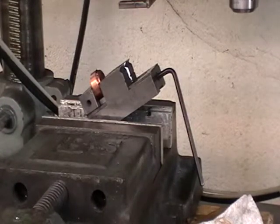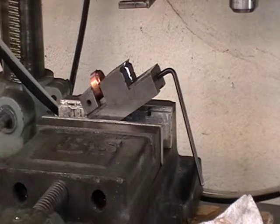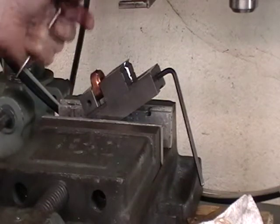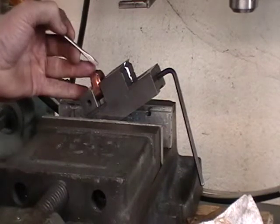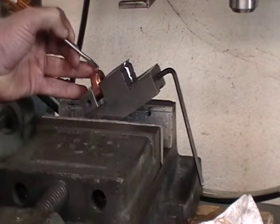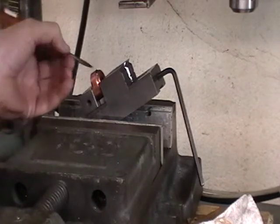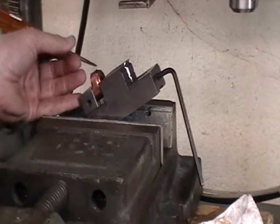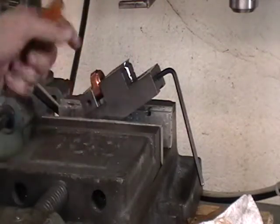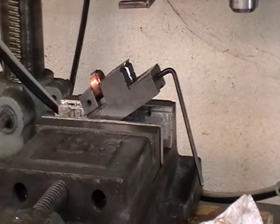You still have to be very careful because it doesn't take much to break that point off. If the part isn't loaded directly — if you're trying to drill this hole and you're off center a little bit with the part, and that thing has a tendency to try to walk a little bit, you're immediately going to break that tool. The trick is the setup. The part has to be indexed, but hopefully once you get that part centered and the drill aligned, it should be repeatable without any issues.